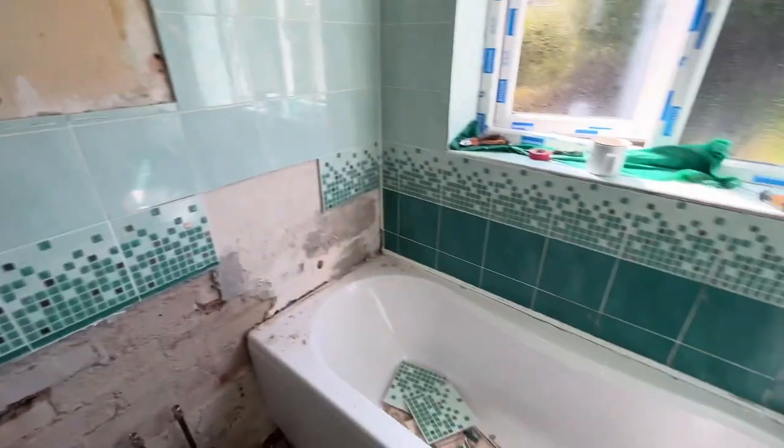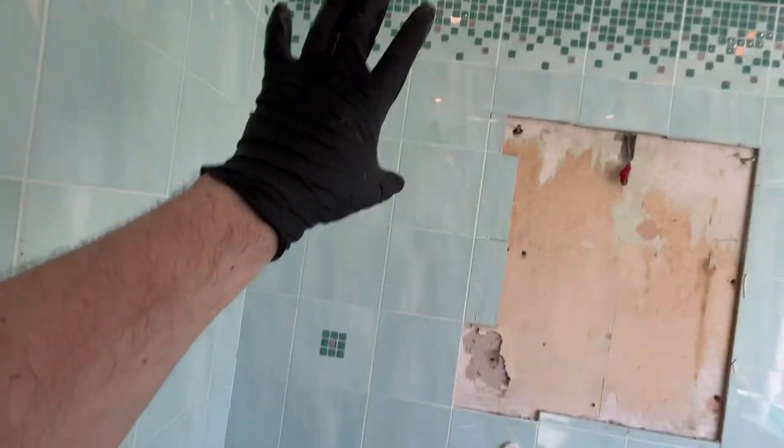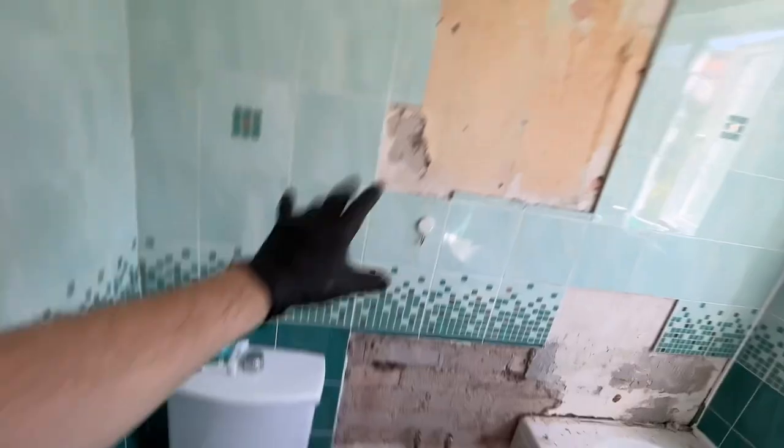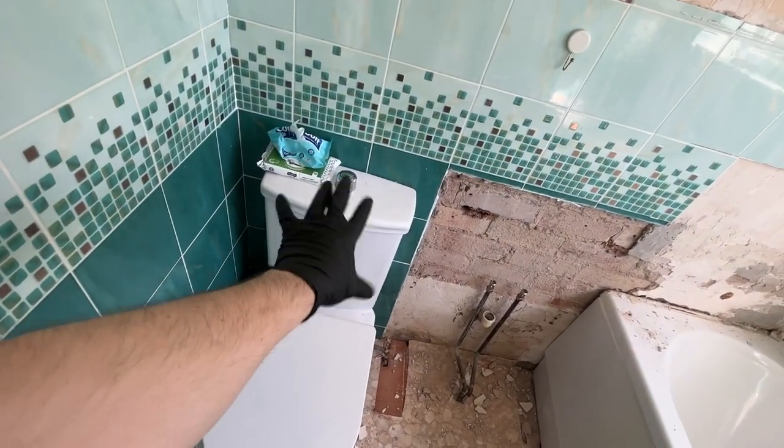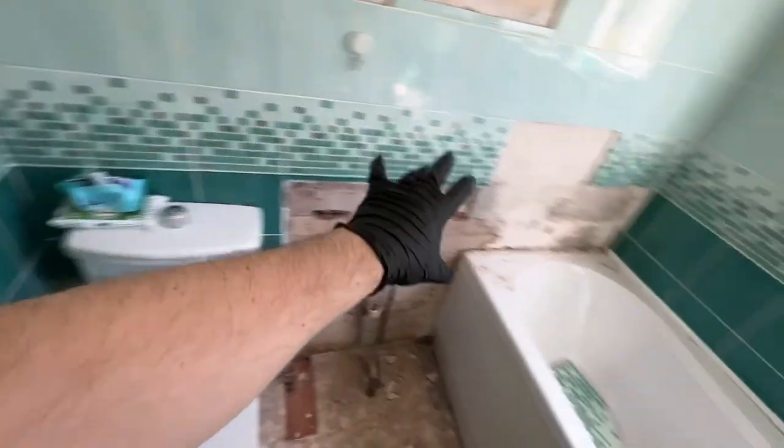You can actually lift the radiator with these plum thumbs. With the towel rails you don't really need to lift it with that, but for a normal radiator it's really handy - you can lift it and carry it outside. Take that outside for the scrap man. Come back upstairs and start ripping the tiles off. We'll start on this side. Like I said before, we're going to leave the toilet in, so we'll probably just leave six to eight tiles behind the toilet and work around it.